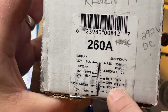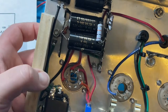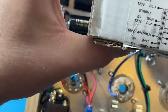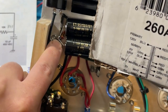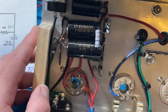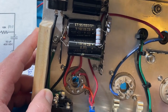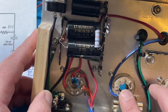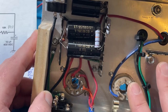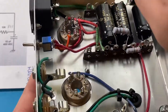In the Hammond transformer we have a center tap; some transformers don't. If this one does have a center tap, you just put the green-yellow wire to a ground point — I would have put it right where my red-and-yellow wire is. What that does is keep noise down from the heaters. The heaters are AC, and that alternating current goes to the tube filaments. In this case we're not using DC for the filaments — you can run DC to filaments in this amp but it's not necessary. In some high-gain amps it can help, but most of the time AC is just fine.